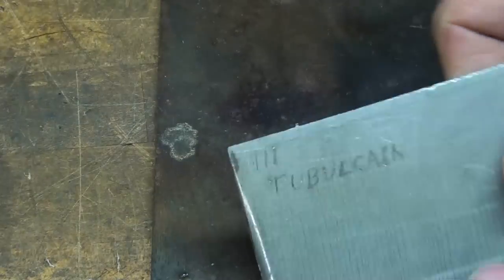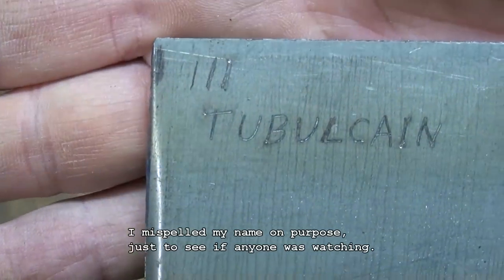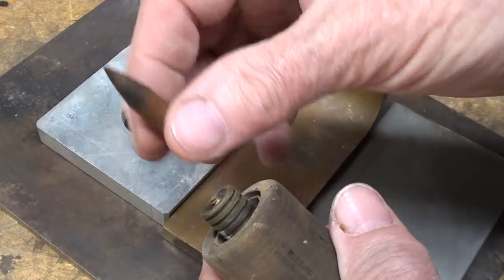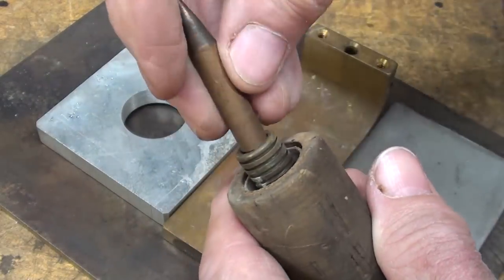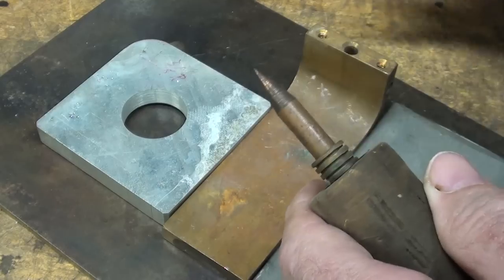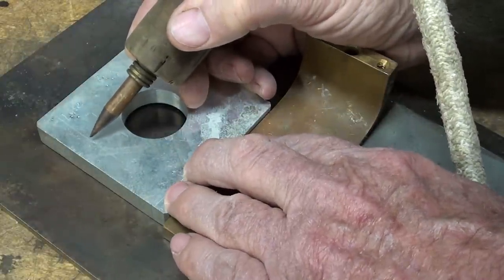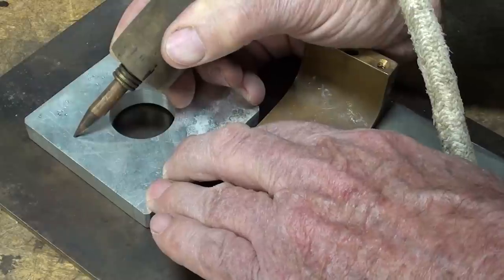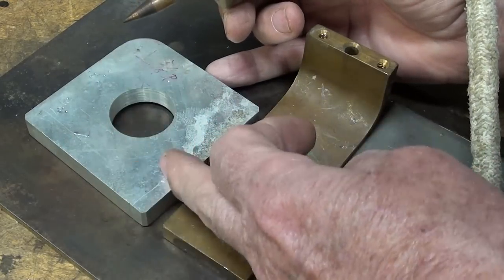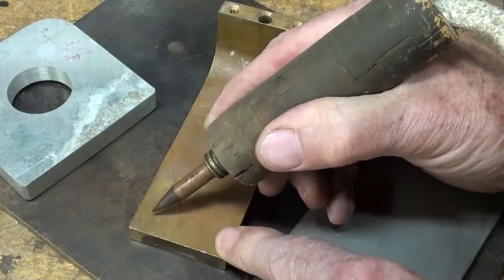That's already getting warm. Pretty neat — etching. You can see this is all there is to the pointer; I was thinking it had an external thread, but it's been tapped — just screw it in. I like to snug it down so there's a good electrical contact. But since this is called resistance etching, you can see that it doesn't work very well on aluminum. I'm surprised there's even a spark — I'm really scratching it here rather than etching it, because I think there's no resistance in the aluminum to speak of.